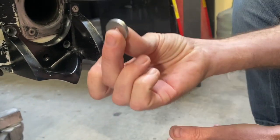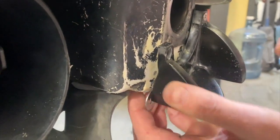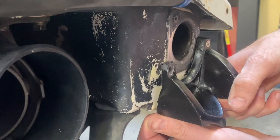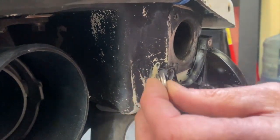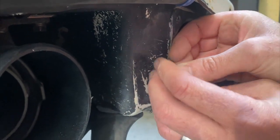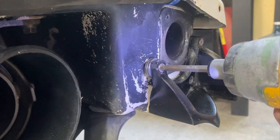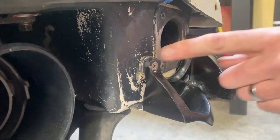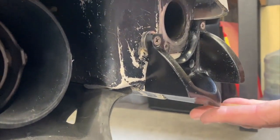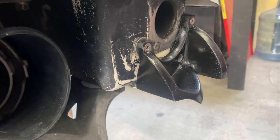So we have three washers that are provided with the kit. They're going to go between the hull extension and the hull, like so. You're probably going to drop these, and you're going to have to find a way to get those three washers that sit behind there. Put in a screw and then tighten it down. If you don't use those three washers, what's going to happen is the hull extension is going to tilt up into the ski, and the planing surface is going to be corrupted — it's going to be tilting up and give you a weird effect on the handling. So it's important to make sure you have those three washers and that it's stable.